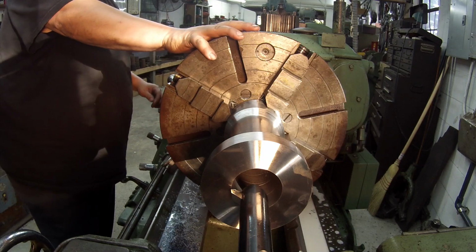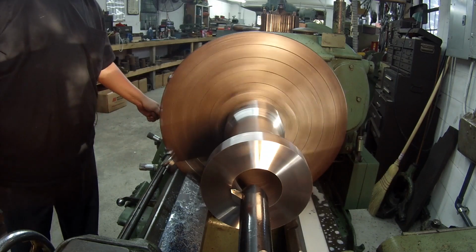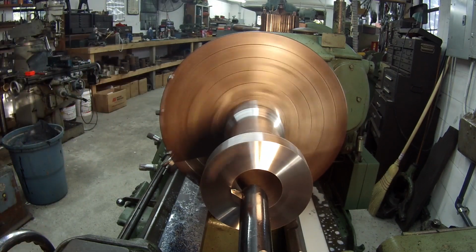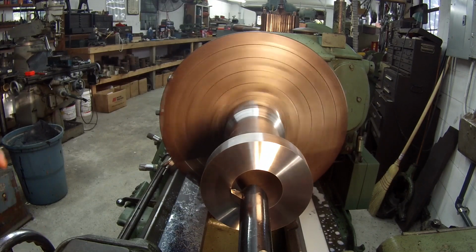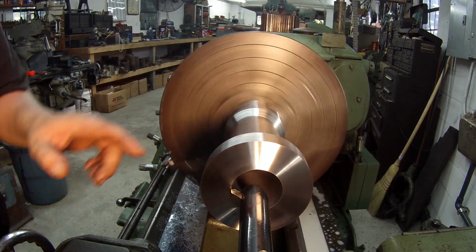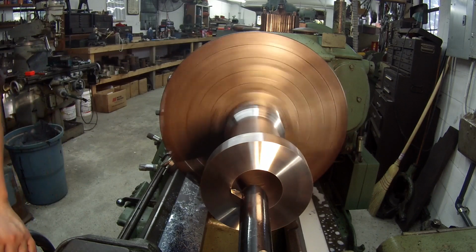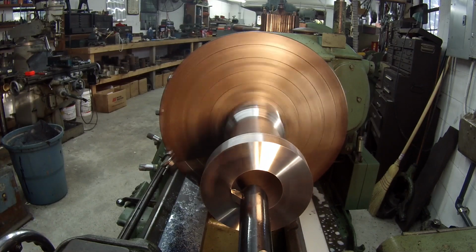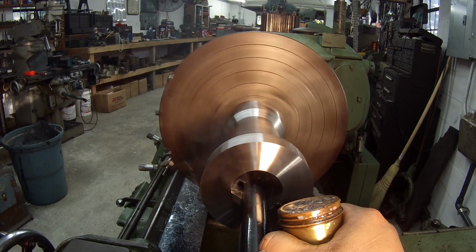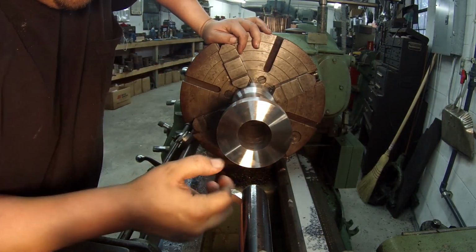Speed it up a little bit. Drop the feed rate down to 5. And I don't want to use flood coolant in a bore like this because it's going to come right on through that and hit them jaws, and it's just going to splash it everywhere, and I don't want that mess. So I'm happy with cutting oil for this. Pretty smooth.